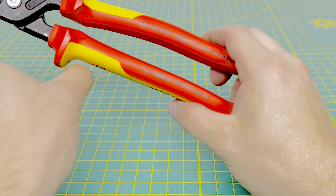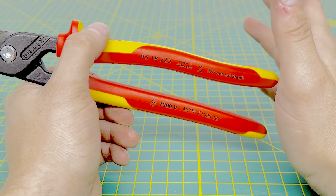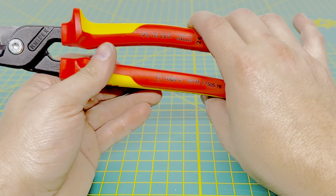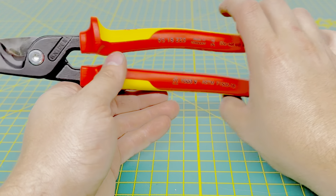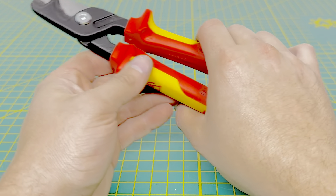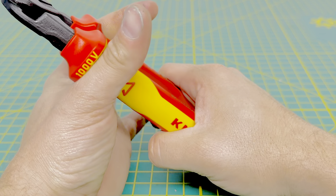These are for cutting through copper wire and your softer wires like aluminum wire. When it comes to cutting through steel wire or anything other than copper or a soft wire, these are generally not something you want to use, and they do print that pretty clearly on the handle. You have all of your ratings down here showing the tool went through all the proper testing and is certified to withstand up to 1,000 volts — I believe they test up to around 10,000 volts. Like almost all insulated pliers, you have those nubs on the top — basically a warning not to go past that point, as you're most likely going to get shocked.